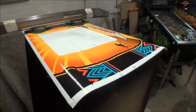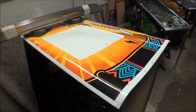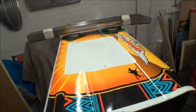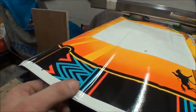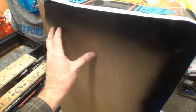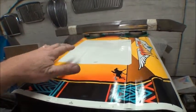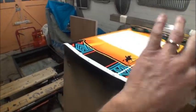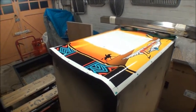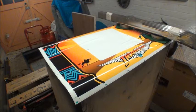And then it's ready to do the disastrous, dangerous bit of peeling it off. And of course, once you start that, there's no going back. It's got to go down and that's it. So you've got to make sure you're very happy with how it's positioned. What I'm doing, I'm putting this end on first, because all of these sections here, that pattern will need to match up with down the sides. Now if I put the side bits on first and they go on a bit crooked, then this will have to go on crooked and it will be worse when it ends up on the other side. So it's best to do this one first, then we can do that side and then the other side, two separate things. So if I have happened to have screwed something up, then I can get over it a bit, but I haven't had any problems yet, I just like to cover all my bases. So that's it, let's have a go at sticking this on.